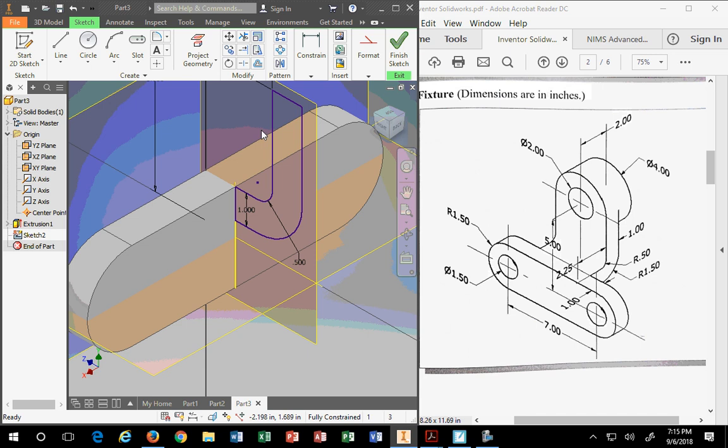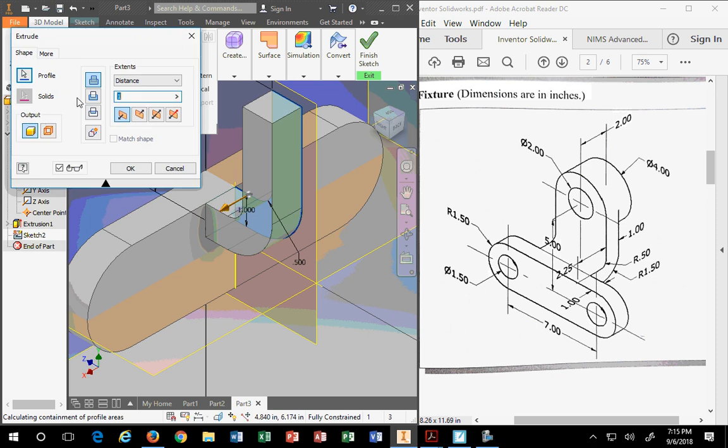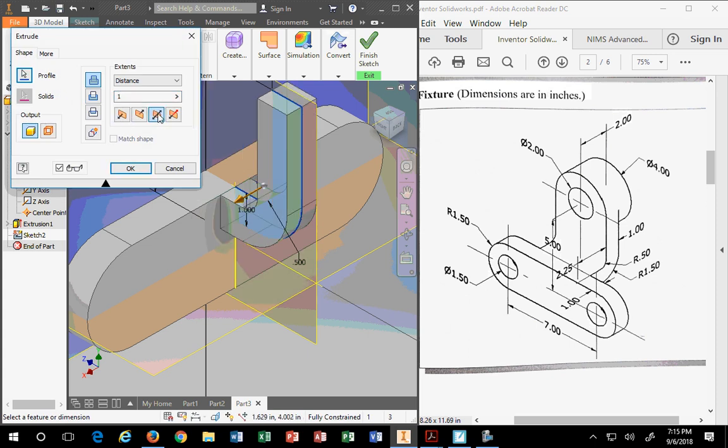And there you go, you've got this shape in the back. Now, I can jump over to the 3D model, jump over to extrude, and here's an example where I do want symmetric. I'm going to identify the width of this object is not unknown. The width of this is actually defined by this other object here, the diameter. Diameter 3, I'm sorry, 4, hello, I got to learn how to read. Diameter 4 is also the width of this object, 4.